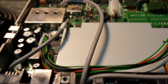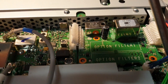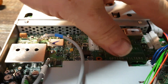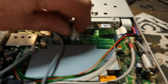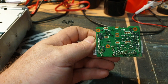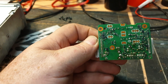There are three screws — one, two, and three hiding behind there — and these little clips snap off. So they will snap off, and basically that whole board comes out. On the rear side of it you've got spots for filters, TCXO, and there are two filters.